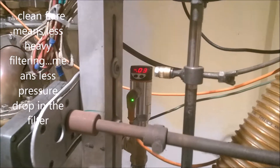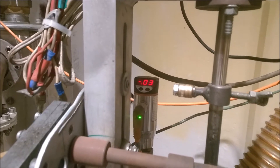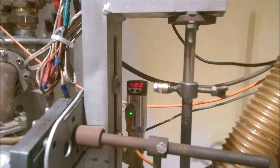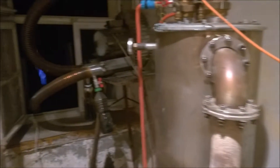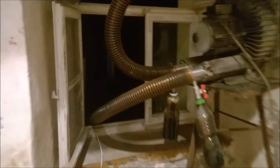We are now running eight hours. And you see, the agitator has to work more than in the beginning, which is normal because more dust in the reduction zone means more packing and so on. But overall, fantastic results. The flare height stays constant. This is unfiltered gas — it's really remarkable how the quality is.